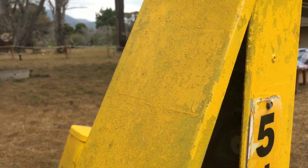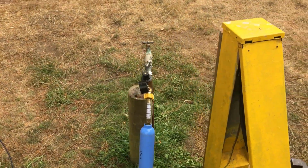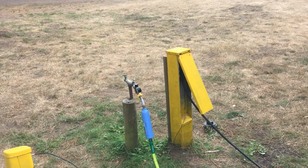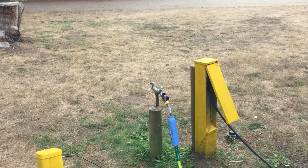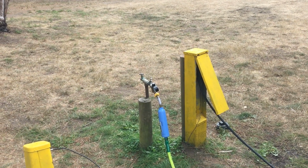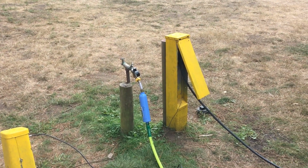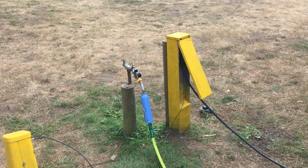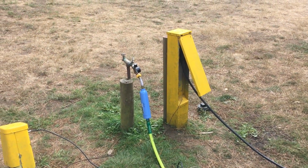And as soon as we hooked it up, we got a low voltage alarm on our protection system, and it's going around 96 volts. The protection system will kick out if the voltage gets under 103 on it. And we booked the site a while ago, and we picked this specific site, and they have cable and water and sewer too, full hookups.